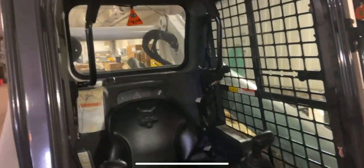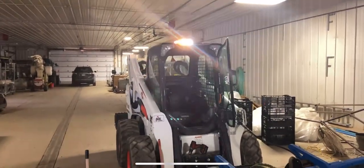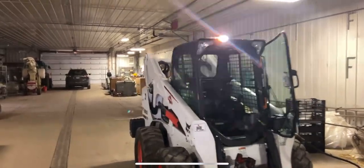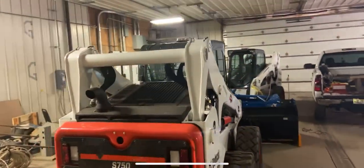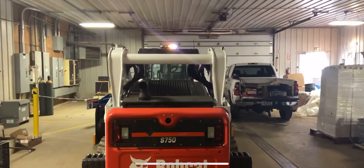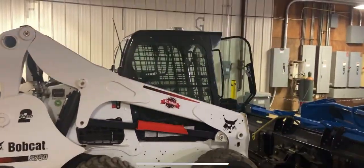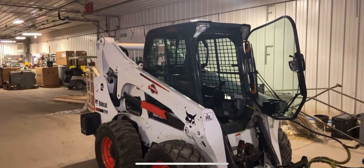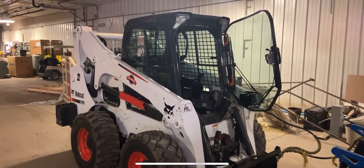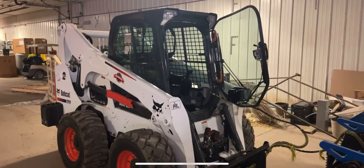And there we are — from the inside of the machine you can see we got all that buttoned back up, we got our side panel back on, flip the switch on, and then from the outside there's our light. You can see it's nice and bright — easy to see, much brighter than the ones we were using, the $20 rotating beacons. These are going to be much safer during the day because even in a well-lit shop that light is nice and bright. Hopefully it'll get people to realize us a lot more, so definitely ready to go for winter. Hope that helped — you're able to get that light wired in using virtually any kind of light you want, just make sure that it meets the Bobcat current draw for that switch, use the right size wires and connectors, and make sure they're safe.